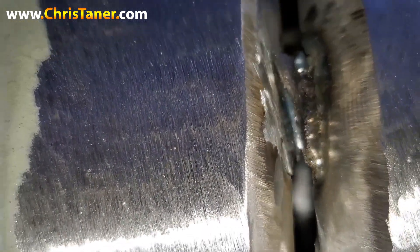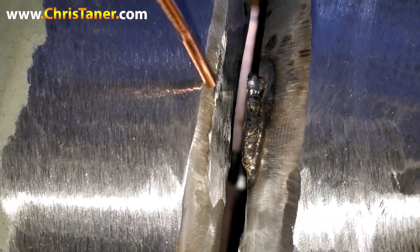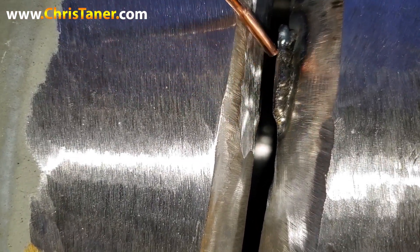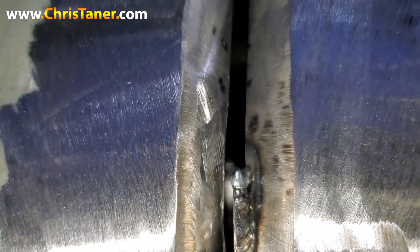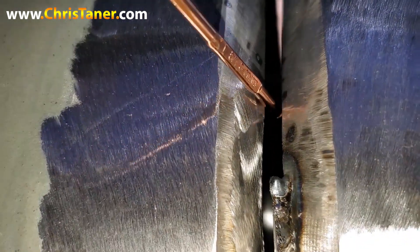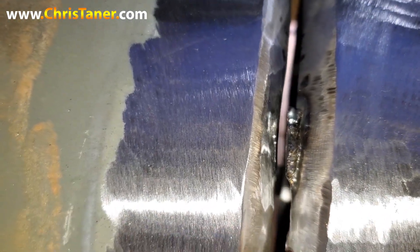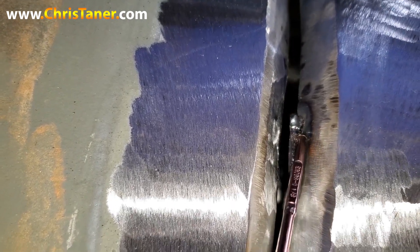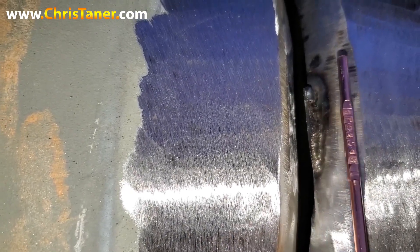As you can see where I began to cut straight through. I held the grinder flat against the bevel and just ground right into it. You can see the rest of the bevel where I didn't weld — you can follow it on out and see it looks the same as I cut the tack out. Just flip the grinder around, hold it flat against the bevel, and take the rest of that tack out.